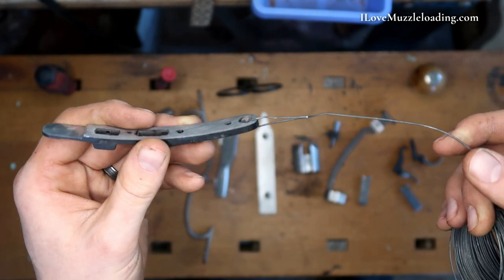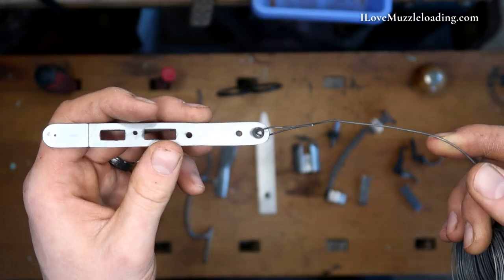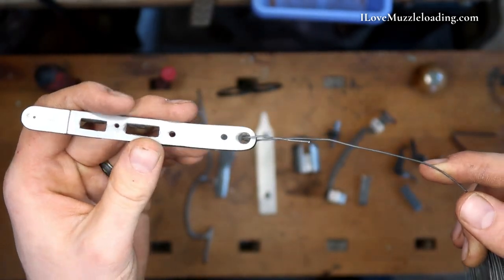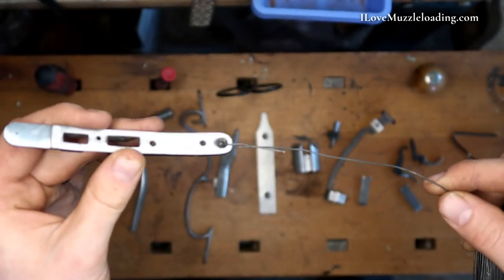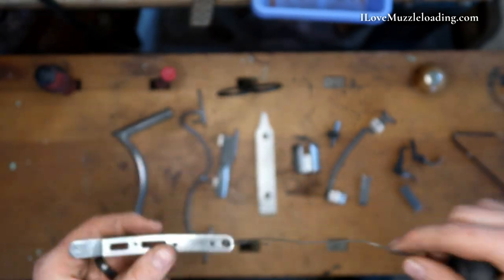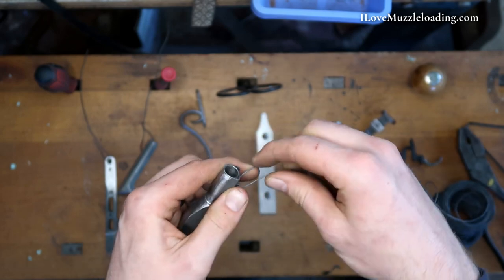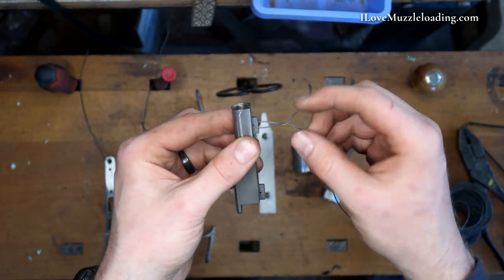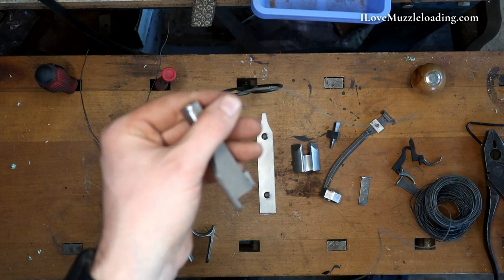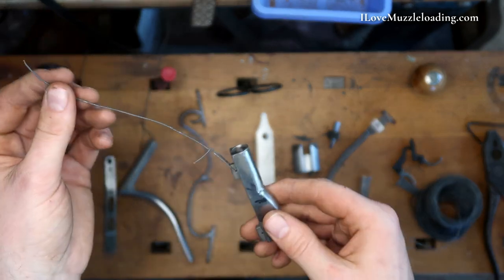This wire does two things: it fits really well for our small parts, but also leaves a really small footprint or contact area on our parts, so there should be very little contact and rubbing in the solution as it's applied. We're going to make hooks for each and every part that we're going to be browning. Most of our parts, we'll use the holes or screw holes that are provided, but there are items like our entry pipe that don't really have any screw holes. My wire is thin enough — I'm going through the pinholes. This way my wire is in no contact at all with the part that's being exposed, so it should be a nice clean rust through that piece.